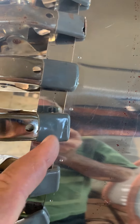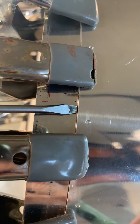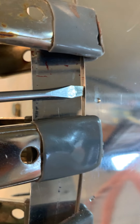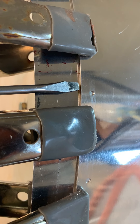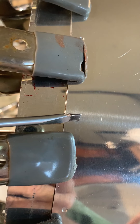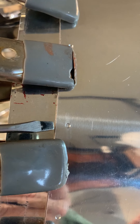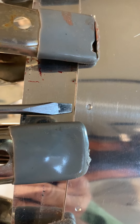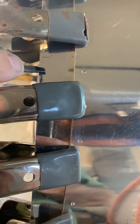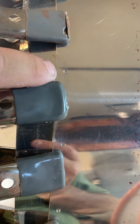As you go around, take a small screwdriver. The important part is to make sure that the shim inside doesn't need to be perfectly flush here — you can see how far back it is, just barely in a little bit, which is fine. There's plenty of room for the rivet to go down through and attach it all. What's not good is if that shim comes out this way, like where the end of the screwdriver is — that's the shim the cowl is going to come up and fit to. So if that shim is sticking out a little, when you go to put your cowl on, it's going to hit right here and you'll have a gap.